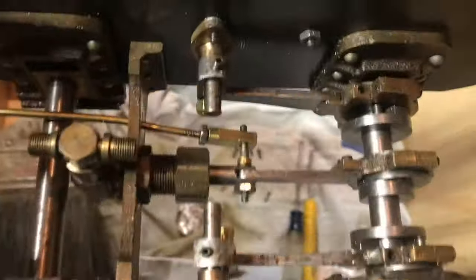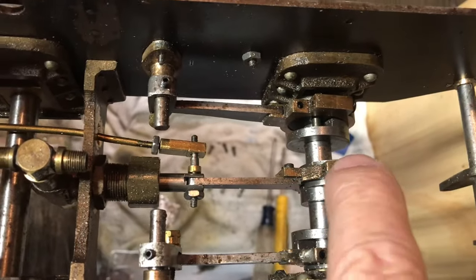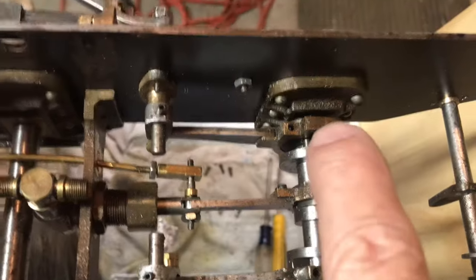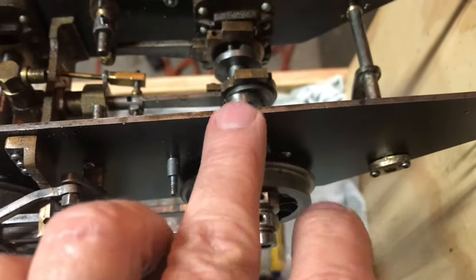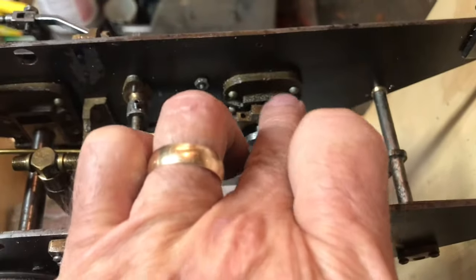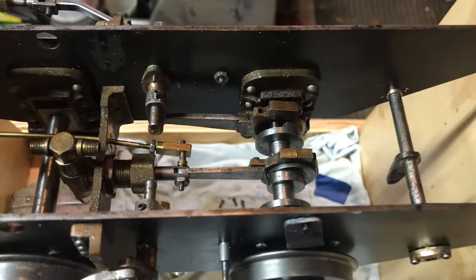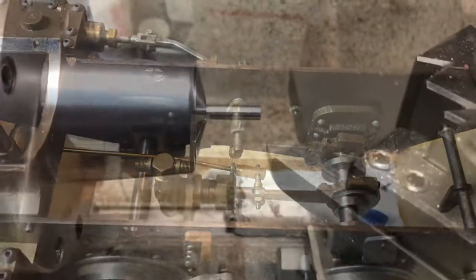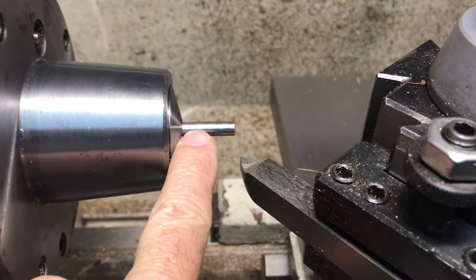And what I was talking about when I talked about the eccentrics before, especially with the slip eccentrics, you've got 3 eccentrics on the rear axle here, and the boiler lugs are resting right here, so there really is not a lot of room for the pan. So all the more reason to go ahead and make a smaller ash pan. And the first step in making the grate, I meant to say grate a minute ago, not ash pan.